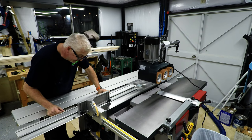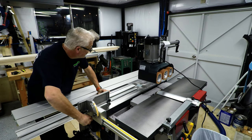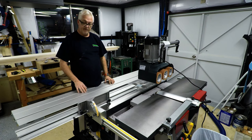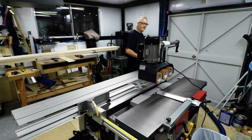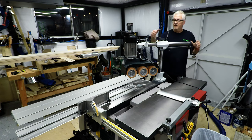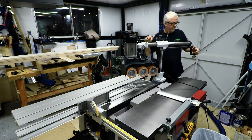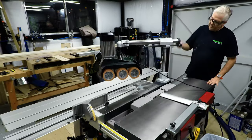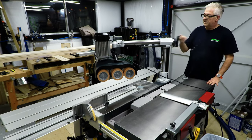I always like to run through the planer and get an exact thickness. I also have a sander, but it's just faster to take it through the planer. I'm going to set that at two and a quarter. What I've done is set my fence back. Felder sells different fences, so maybe the other fence might be a little better for doing this. I'm going to go ahead and get that lined up, loosen this up, and start cranking that — this takes a little time.